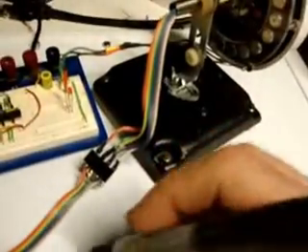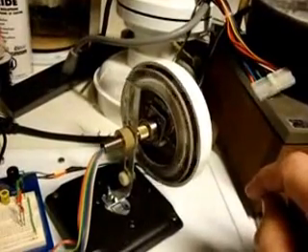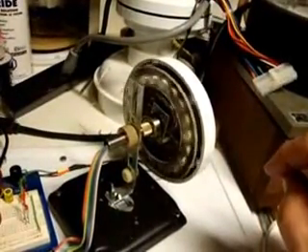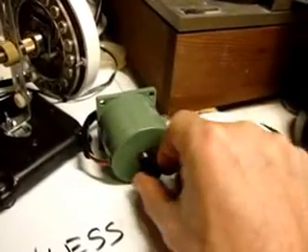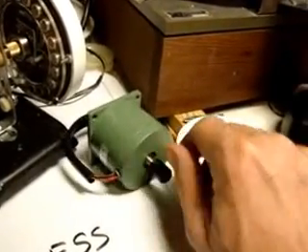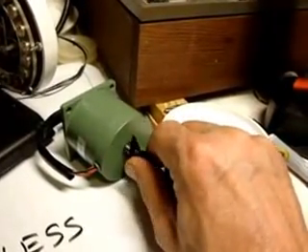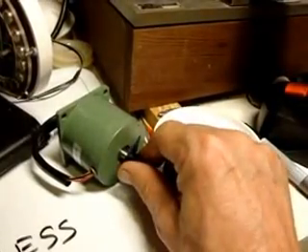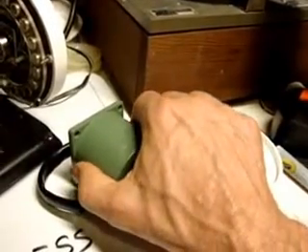What this is, first of all, is ironless. By being ironless, that means that it can turn freely. There are other motors that have similar qualities, like the stepper motor here. I can turn the stepper motor as fast as I want and it won't free spin, because it's got iron in it and it's attracted to its various little poles along the way. So it cannot free spin, although it does many of the things that this motor does.